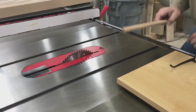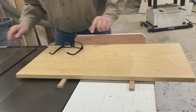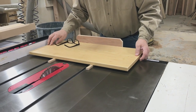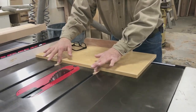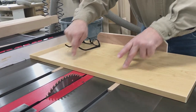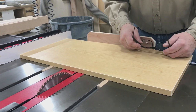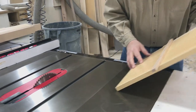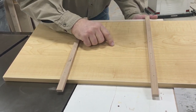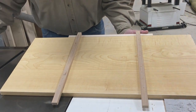I put my two pieces in there. My board is 14 by 29 inches and I wanted my saw to be in the center, so I set my fence at 14 and a half inches. I put my runners in, put my fence up against my board, and then nailed down two nails into my pieces. That made my table square to my saw blade and square to my runners. Once I got done with that, I turned it over and nailed quite a few nails on the back side to make sure the runners were good and tight. Then I waxed them, cleaned them up, and sanded the corners so they would ride smooth in the tracks.